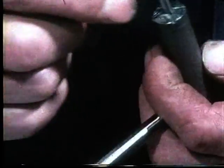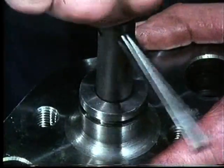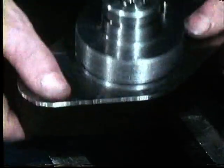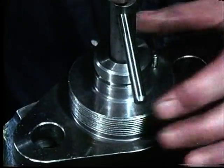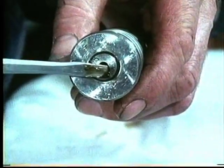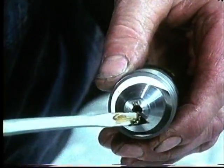The special tool shown here is used when grinding. The grinding medium is Carborundum 500 and a few drops of oil. The pressure spindle's lower and upper seats are ground with the same grinding material but with another special tool.